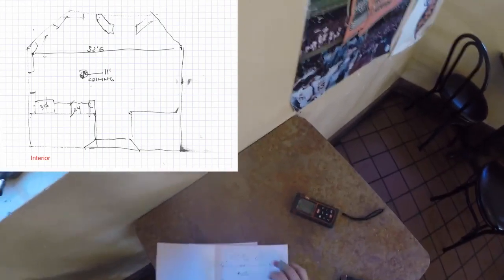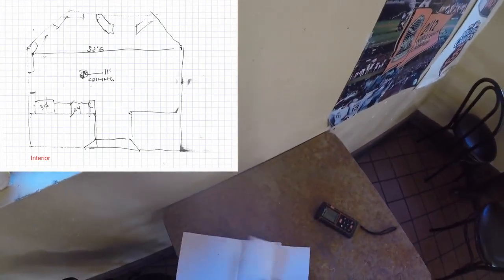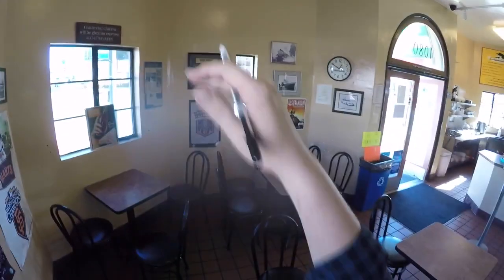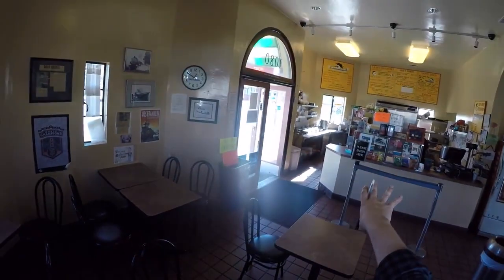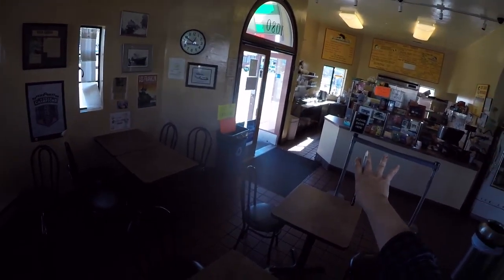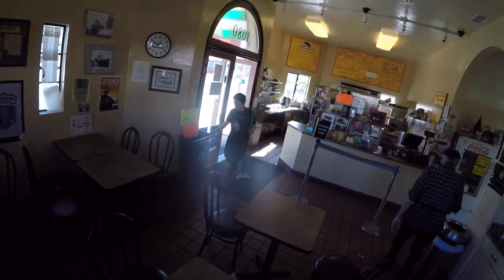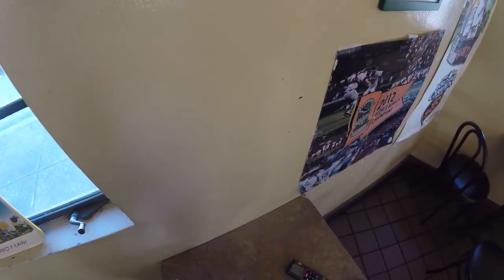You might need to do more breakout drawings, but you're doing dozens of sketches, right? Lots and lots of sketches, lots of dimensions. You know, the interiors, understand the heights of all that stuff. And of course, don't worry about back of house. We'll estimate that kind of thing. Go in whatever bathroom you can get into. And you want to measure just the centers of things.